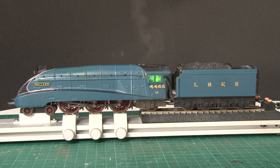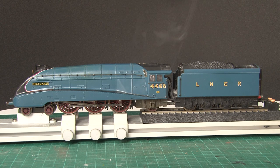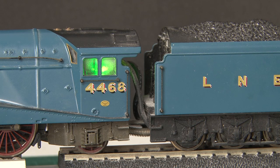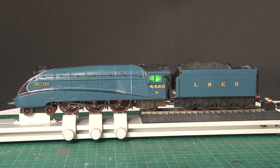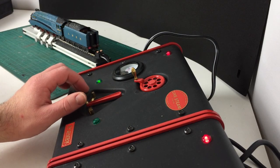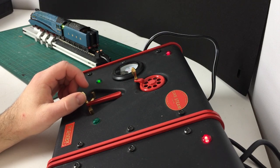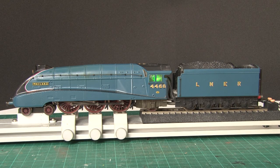The engine is now ready to go. As you can see the safety valve is blowing off every so often, which means we've built up enough pressure, so let's get it moving. The engine is currently set in reverse so I hold the control lever in the opposite direction and we should hear a whistle as the gears switch. Once the whistle stopped I released the lever and now the loco is set to run forward. I'll just start by clicking the lever in the forwards direction a few times — usually it takes five clicks before anything happens, and this just takes up the slack in the mechanism. And yep, there it goes! Isn't it just fantastic?